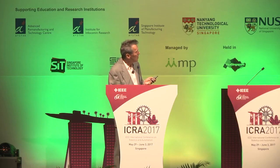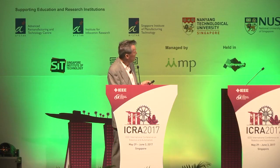Later, we were looking at arthropods like lobsters and the different angles of the joints. And then these two findings can be, by heuristics in analogy, transferred to a new joint lever system together with exoskeleton, and this way you can check on the shape by finite element analysis, and we are getting a modular arm system derived from nature without looking like the natural paragon.